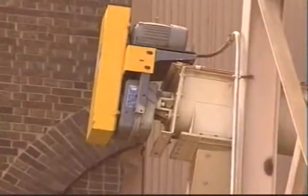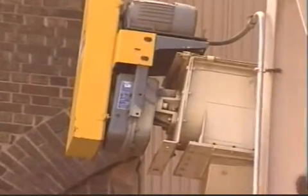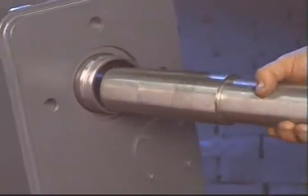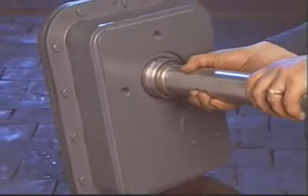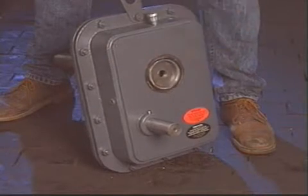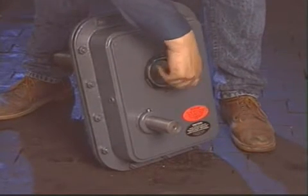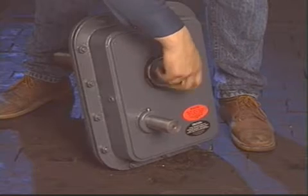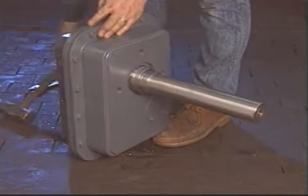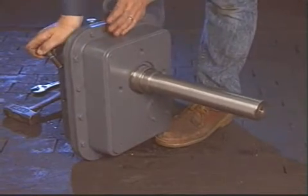Falk's screw conveyor Quadrives are also designed for easy installation and removal. Tapered and center relieved, the drive shaft mates with the low-speed hollow shaft and is held in place by a thrust plate. When removal is necessary, a removal bolt replaces the thrust plate bolt. Once the removal bolt has been tightened, a few raps with a mallet will loosen the drive shaft.